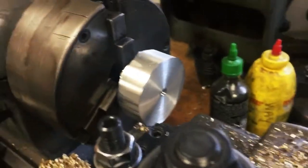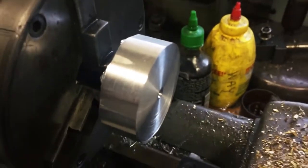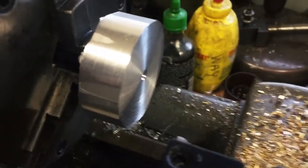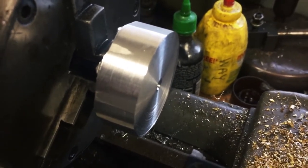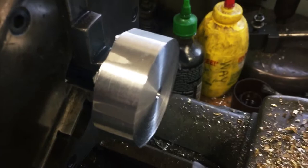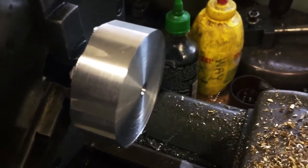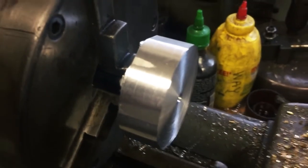So I'm over here at the lathe right now, just getting ready to set up a mandrel, a threaded mandrel. I know I have a 3-jaw chuck, but I threaded it in place, haven't touched it. Screw the blank on up to a shoulder, and then I'm gonna cut these pistons 5 thousandths under the bore, which I believe is what is recommended, and then cut in for the 2 cast iron piston rings, which I have. They were set up for 2 inches, so I should be good with that. Make 2 of those. I've got the piston rods done, so we'll be able to test fit those in a little bit. And we'll see.